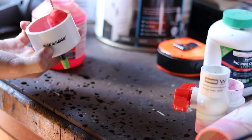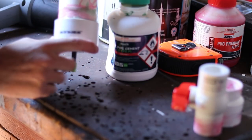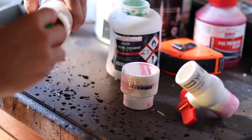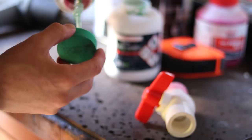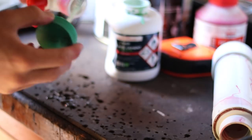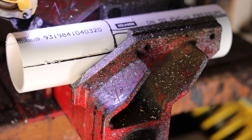After it's all cooled down and hardened, you're simply going to need some high pressure glues — I have a PVC primer and a high pressure cement. The best way to do this is to prime each side of your joint, let it dry for about 30 seconds, and then paint the glue over the top of the primer. When you're pushing your joints together, you want to give it about half a turn all the way around as you're pushing it in — that will give you the strongest, most airtight joint. You're going to need around 24 hours for all this to dry before you put any pressure in it, so don't go putting any pressure in early or it will just blow.